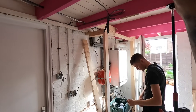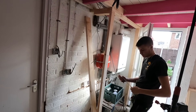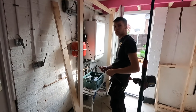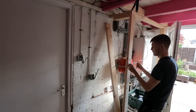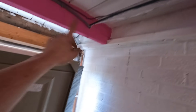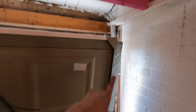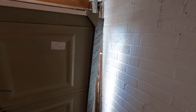We're doing the lighting box in there - the light feed goes in there and we'll do that on second fix. We'll put an adaptable box because there are quite a few cables going in and we'll label it all. Adam's run the 10mm and the boiler feed up through the ceiling. The front end of this garage has all been knocked out and bricked up so we're leaving loads of slack for it to be pulled through as needed - there's gas pipe next to it so it'll probably all be boxed in anyway.